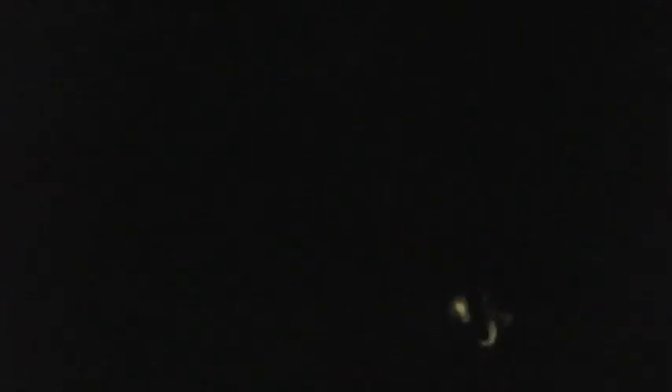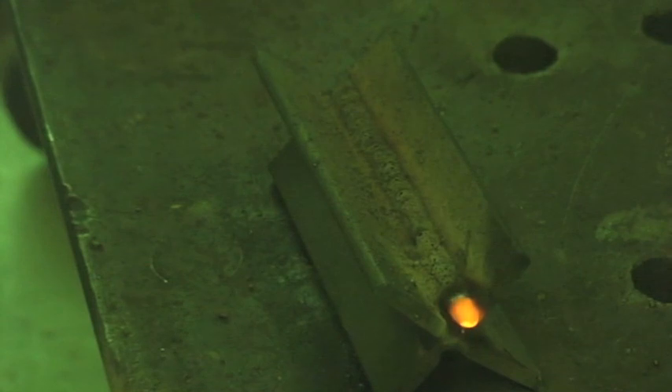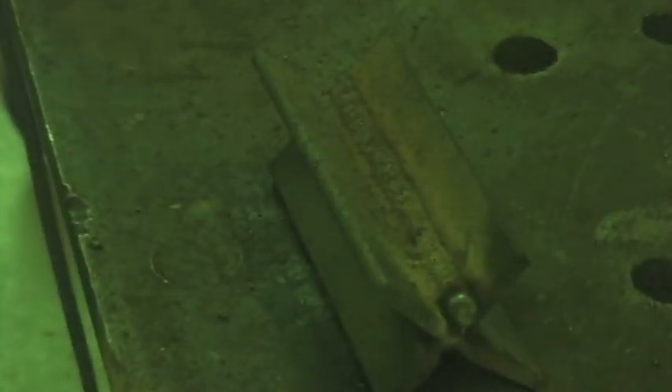Lastly, this is in real time. If you ever wondered how to finish off a weld, here it is. Come out and come back two, three, maybe four times, and just give it a little shot of weld every time — as if you're simulating a whip and pause. This will fill the weld, it will fill the bead to the absolute end of the plate, and it will look nice and even and smooth.